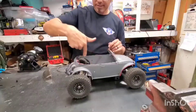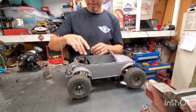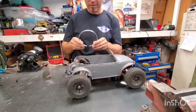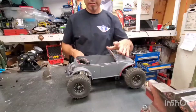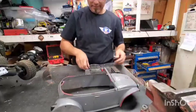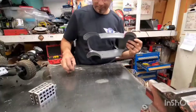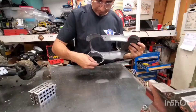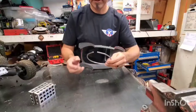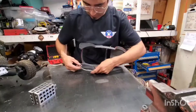The next piece is going to be the wheel arch for the back. I'm going to go back that way so I can figure out where I want my shocks mounted — I think I want them at a forward angle just because of the look of the build. On the ring roller I went to the tightest radius I could get and bent up this piece, which looks pretty close to the shape of the arc. Now I'm going to use the ring roller — the ends have a little bit of an unusable section — so I'm going to line that up as one of my cut pieces.